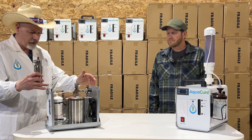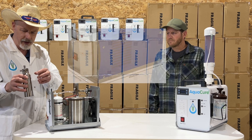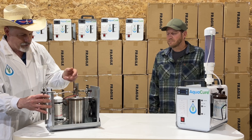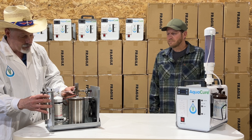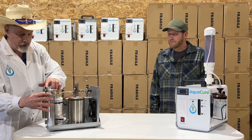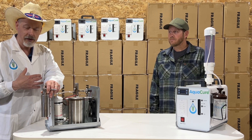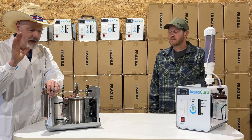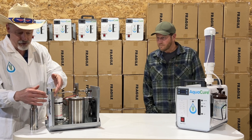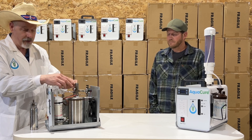Originally, these chassis that come from China have a particular filter on front, mostly filled with water, with a tube that connects over here when mounted. That's how the gases get over to here. When you've got those little tiny droplets coming out this tube, a lot of lye ends up over here. When you're operating this with a torch, that really doesn't matter — not a big deal. But when we're doing it for health purposes, it is a big deal. We want to make sure the lye stays in the machine. So we took this off the front. What we're talking about is making sure you have as little lye as possible.